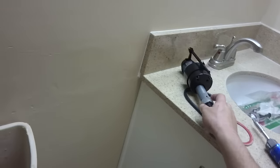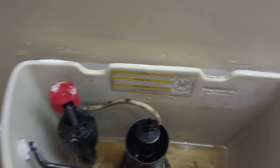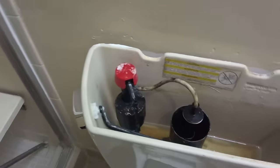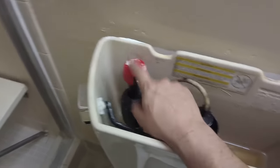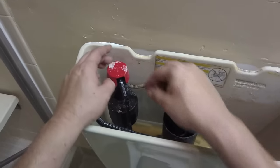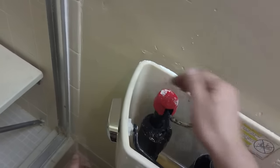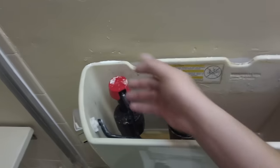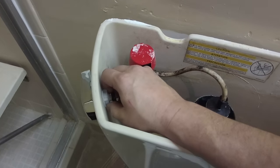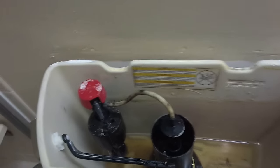So that's some tricks and things that you can do. Again, if you have a slow toilet, check that. Like I said, you can snap off this thing, open this up, check that little rubber seal. Hold your hand over it like this and crack the valve if you want — it might blast out some grit, calcium buildup, whatnot — and you'll be in business.